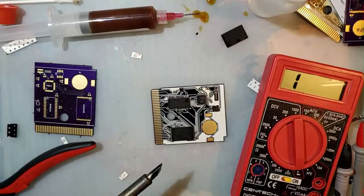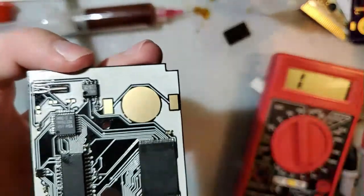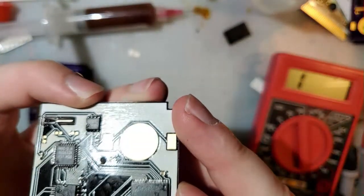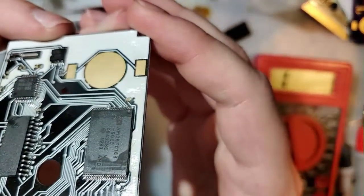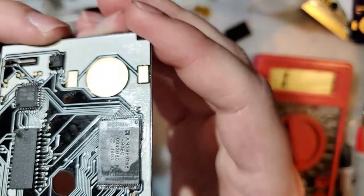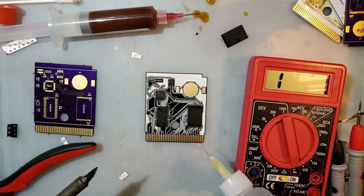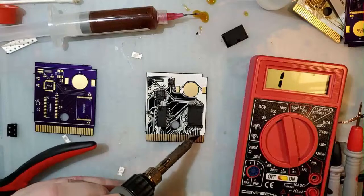Check the middle bottom pins there, two grounds next to one of the VCCs. I'm assuming you mean middle bottom of this chip right here where I'm pointing. It's actually just what I was looking at. Because some of the pins on this chip are a little bit crooked. Might just pull the chip entirely. I mean, I don't see any shorts, but that's where I was looking.